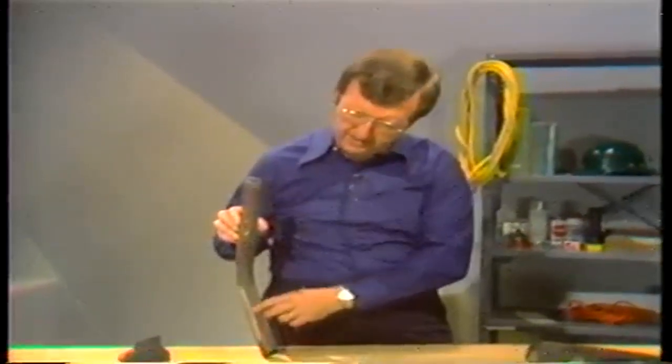When you inspect the tubes, you have to be aware of the amount of tube thinning that can be tolerated before repairs are necessary. Now, to some extent, tube thinning can be determined by looking at and feeling the tubes. You can tell that local thinning caused by erosion has occurred because you can see and feel a gouge in the affected tubes.